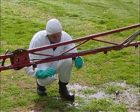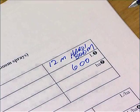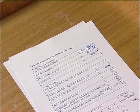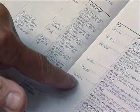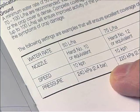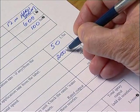When you're satisfied that everything is in proper working order, you can start calibrating the boom spray. The first step is to record the capacity of the spray tank in litres and the area to be sprayed in hectares on the calibration template. Read the chemical's directions for use section of the label to find the recommended chemical rate for the pest you're aiming to control. The general instructions area of the label will have any recommendations if there's a specific water application rate per hectare or a particular pressure to set your sprayer. Record this information onto the calibration template as you find it on the label.